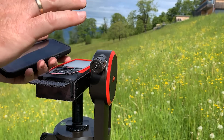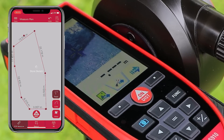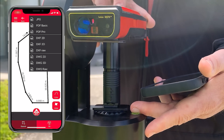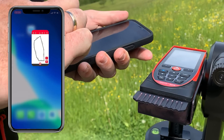Important points such as tree cover can also be recorded in this way. I can export the measured plan as DXF or DWG format for further use in CAD. My personal tip: if you use the DXF or DWG raw format when you export, the height differences of the measured points are included.